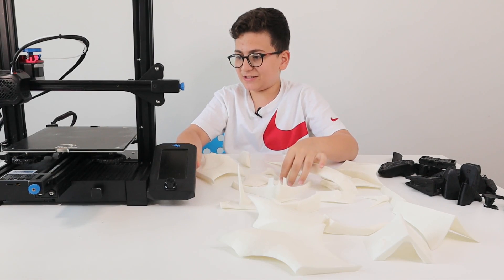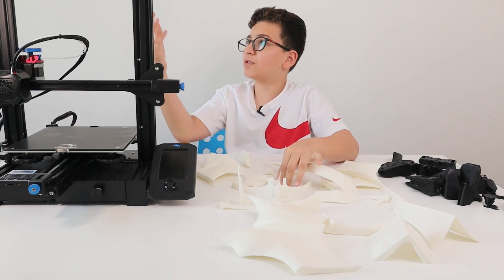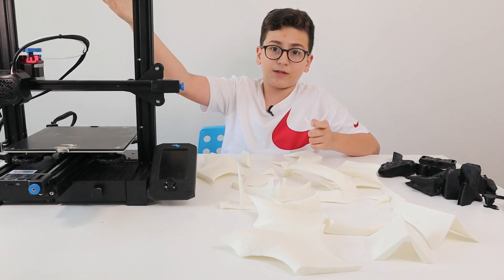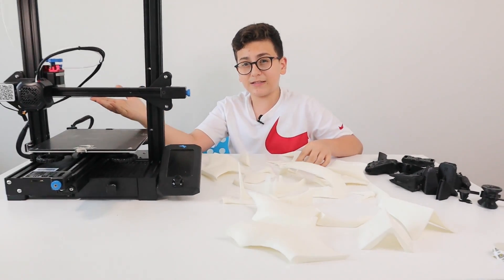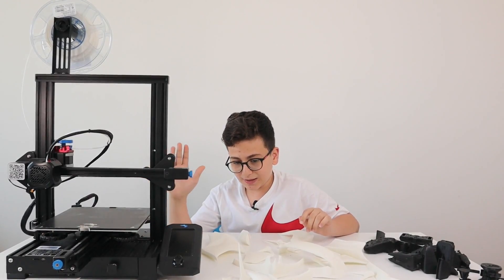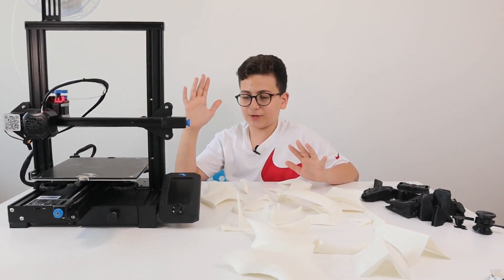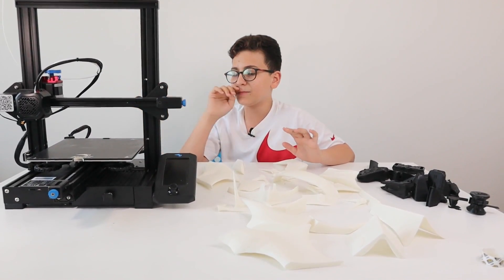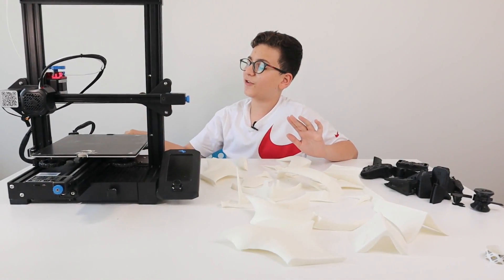That's retraction size. We also got a new filament called PLA Plus. We have to increase the heat to 235 degrees and the bed heat to 85 degrees. Also, I didn't need to put anything for adhesion — no glue, no hairspray. It just adhered by itself, which was great.